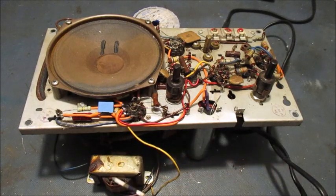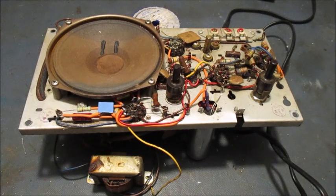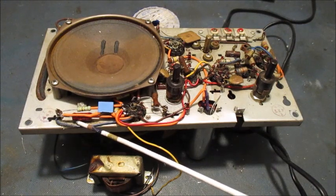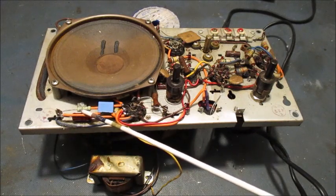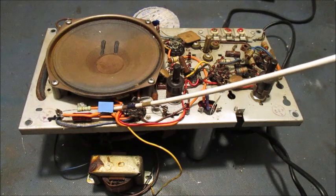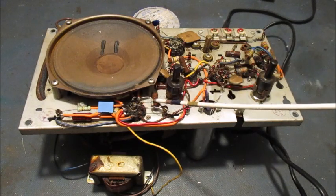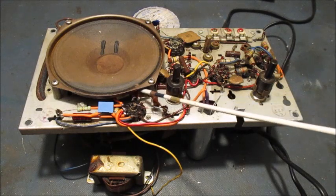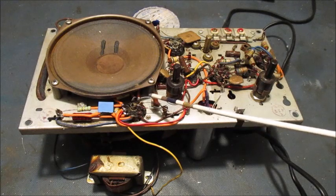One replacement transformer fitted, and whilst I was in the process of replacing C26 10 nanofarad top cut capacitor, I'd just as well tolerance check the cathode resistor, 270 ohms, as well as tolerance check R12 470k grid 1 bias resistor, R11 110k triode anode load resistor, R10 that is a 5.6 meg triode control grid resistor, and C22 and C23, both underneath the speaker and onto the other side, and they are 10 nanofarad at 400 volt coupling capacitors.